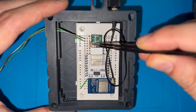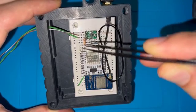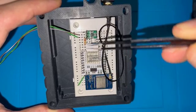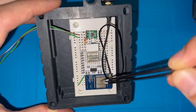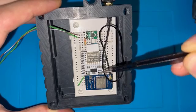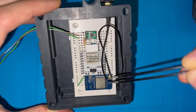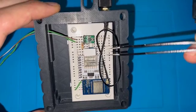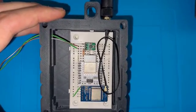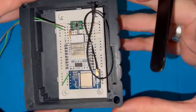I'm also using a voltage divider to let my MCU read the voltage level of the battery, so I can report this over the LoRaWAN network and have an idea about the battery status. The LoRaWAN module also contains an internal temperature sensor, so I can obtain surrounding temperature information. The LoRaWAN module will be broadcasting over the 868 MHz band. I also have my LoRaWAN gateway elsewhere, and here is the antenna I'm using, housed in a 3D printed case.